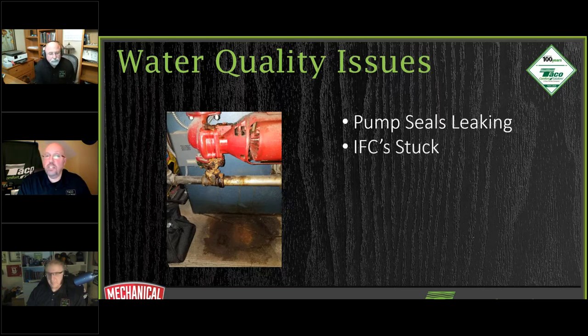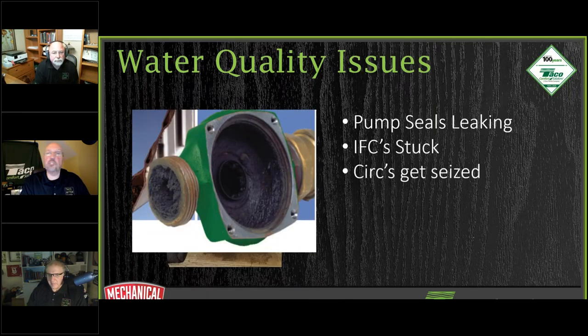Your IFCs. I know a bunch of people out there that hate the IFC because they get stuck all the time. And then meanwhile, we've got tons of people out there that say, I've got no problems at all, they work great. You might have a water quality issue, and it's going to be dirt and other things in there. We're getting seized circulators prematurely.